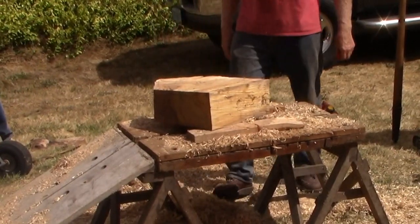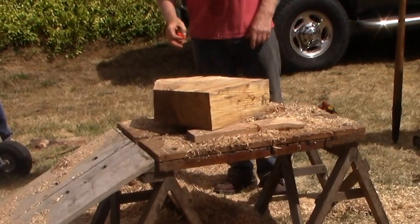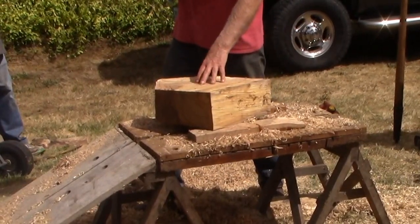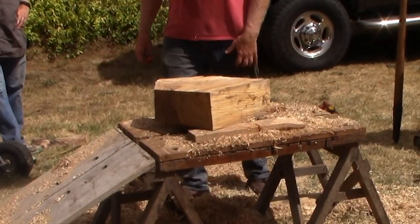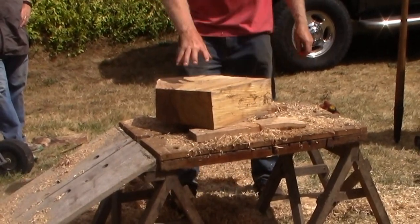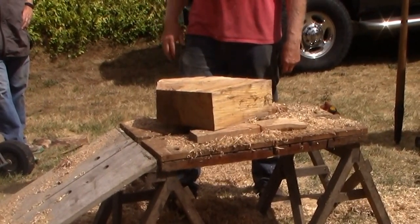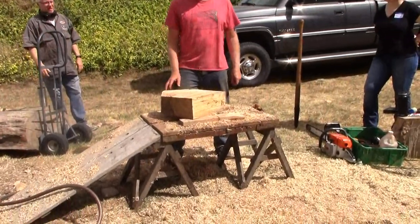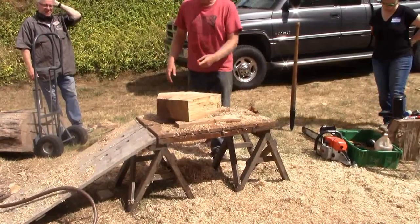Do you finish the tenon or do you just cut it off when you're done? Well, like on this one, it's going to be part of the finished piece. I'll flip it over when I get all done and do the bottom, right? If I'm doing burl like maple burl or madrone burl, I actually use glue blocks. I'd use a chuck to rough it out, but then I use a glue block when I go to finish turn it, because I use face plates when I finish turn. So I'd put a glue block on here and use a faceplate when this is dry to finish turn it. So anyway, this is a nice feather.